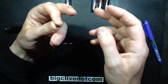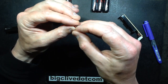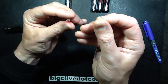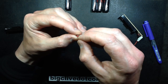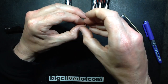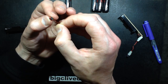I'm almost done winding. Then I'll tin the ends — I'll show you how to do that. The easiest way to strip the ends: when I was younger I used to bare the lacquered wire using sandpaper, but it's actually easier with most of these wires to just use a soldering iron. Run some solder on the end of the iron, then pass the tip of the wire through it. That melts the lacquer and tins the copper at the same time, which is very handy.